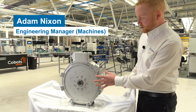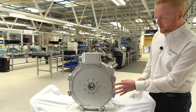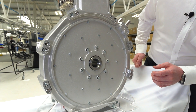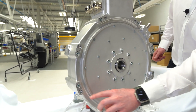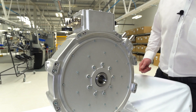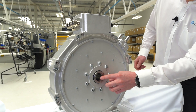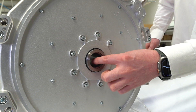Starting with the front face features, there are two main options for concentricity alignment. Firstly, dowel holes within the motor can be used to maintain concentricity, as well as a spigot feature newly introduced in this product. This diameter sitting within the raised castellated regions can be used for a mating spigot feature, which is a very common feature on existing technology such as gearbox and flywheel housings. This is shown here with a dummy shaft for marketing purposes, so it doesn't show the female spline.